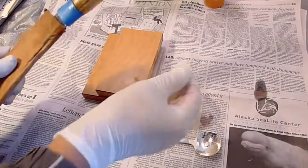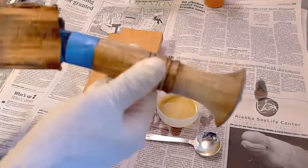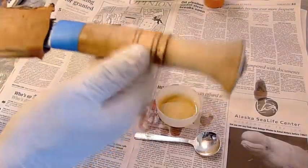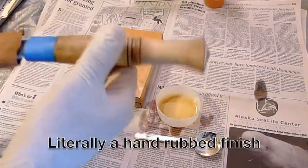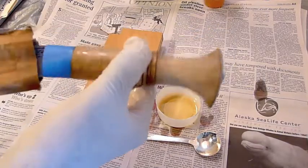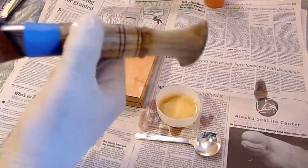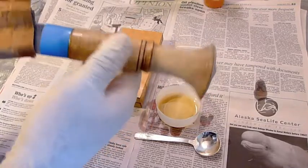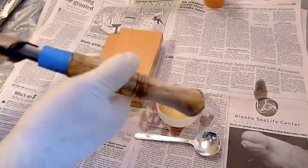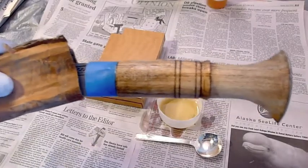Here's how I do it. You get some of the mixture on your fingers and rub it into the wood. You rub until it's hazy — you can see a haze on the wood. It's pretty easy to do. Just want to make sure that you get it all over the wood. This is the first coat that I'm putting on, and I plan to put on 10 coats for maximum protection with this wood. It's a little bit hazy, and you just wipe it off with your towel — a shop towel or any lint-free rag.